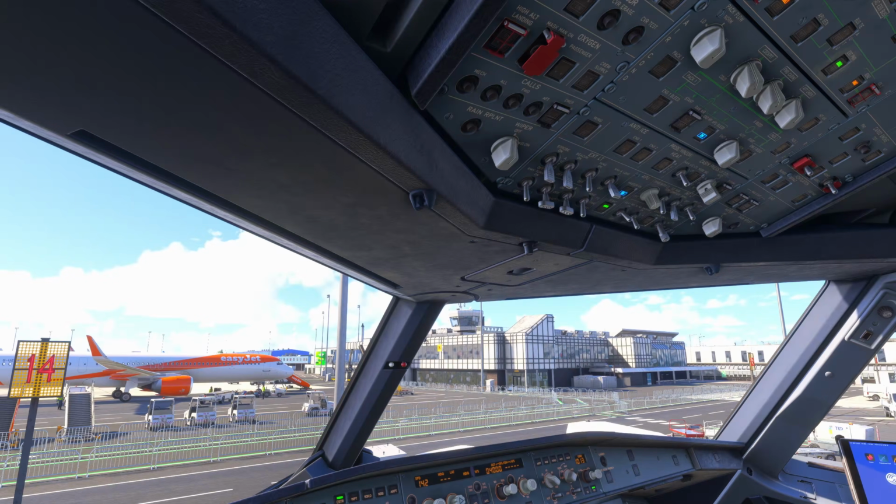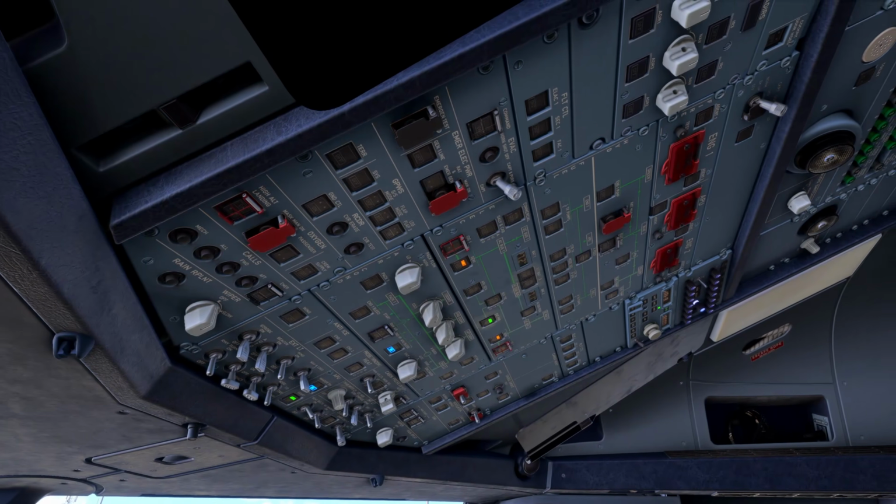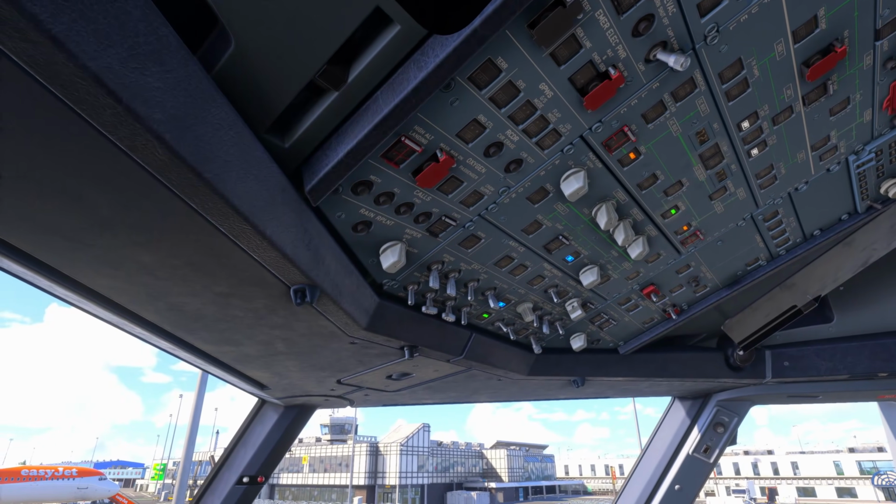as the aircraft continues to be electrically powered. The fuel pumps as required, so with my operator on a turnaround, if we require refueling, we would turn the center tank transfer pumps off. If we don't require refueling, they can stay on. And we don't turn the wing pumps off during a turnaround. We turn the center tank pumps off to ensure we don't get low pressure cautions and to avoid fuel spillage.